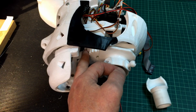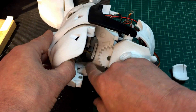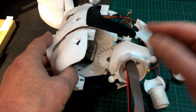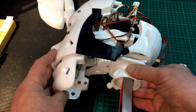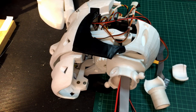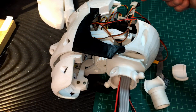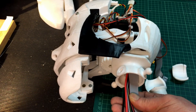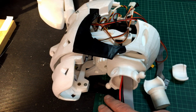The loudspeaker section inside got knocked. The loudspeaker sat in there, which I might actually take out because of the additional weight it adds to the whole head and movement. I might put the loudspeaker back in the body. Also while I'm modifying this, I'm going to change some of the wiring — the cable breakout that runs the neck is broken out in the head and comes back down to the body. I want to simplify all of this.